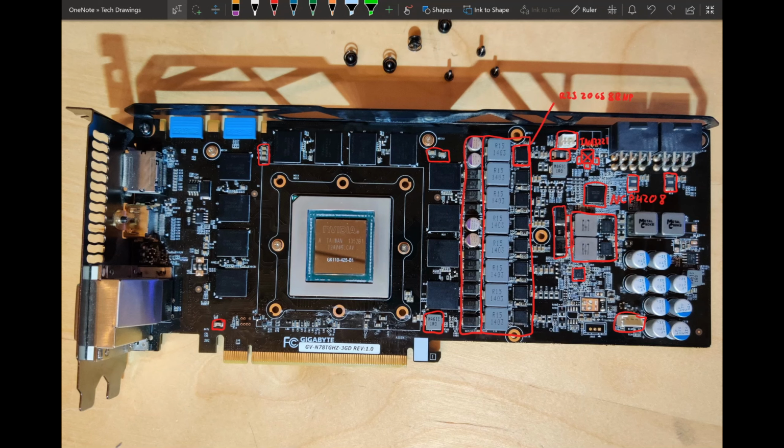And if I get the card repaired, just like I said, the memory modules have to be replaced. By the way, if you're wondering, pretty much all my Kepler-based cards are running on Hynix AFR, 2 gigabit AFR, so is this one. There's some exceptions. I have a 680 on MFR, and my 780 Ti Matrix is using BFR, which is very, very good as it seems. But I pretty much only get Hynix. The only non-Hynix card I have is the 770 Jetstream, which is on Samsung D-Die. Those are the memory chips I have. AFR seems to scale with voltage, at least on my 7970 Matrix, but I haven't tested on any NVIDIA card yet.